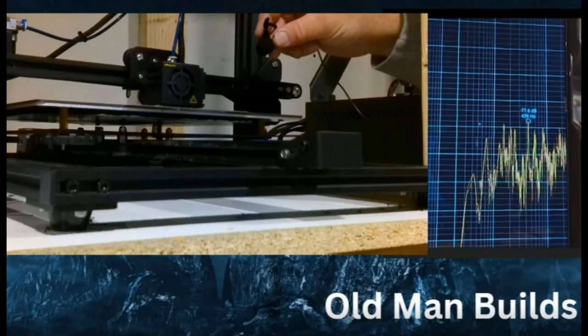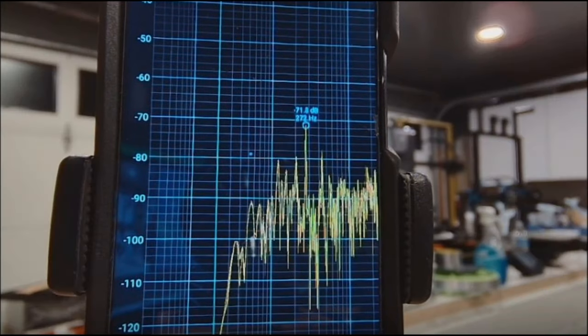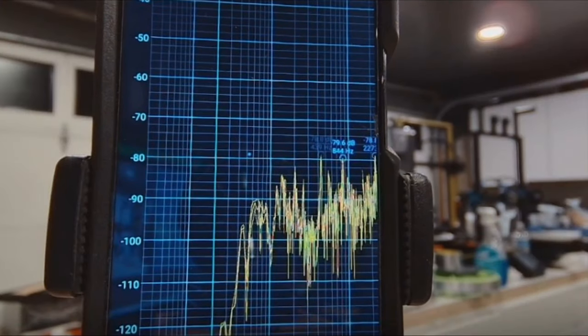Let me break this down further. We're going to start looking at beats going on between the actual RPM of the motor, what's going on with the Tesla coil, and how they light up the fluorescent light. This test is my 3D printer resonating — I'm showing it because it's a known point of resonance, so I can extrapolate how my center plate of my gravity flyer will work. The identified resonance frequencies are: 155 Hz, 246 Hz, 272 Hz, 439 Hz, 586 Hz, and 844 Hz.